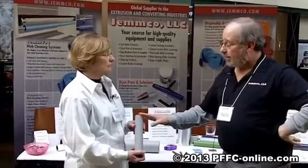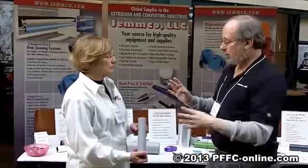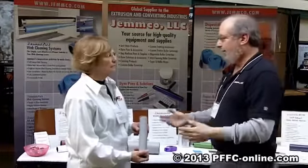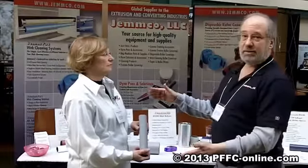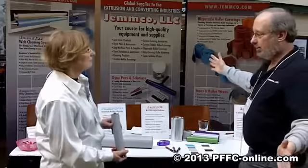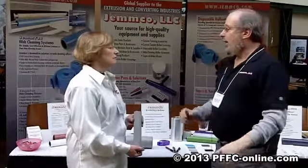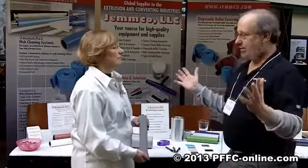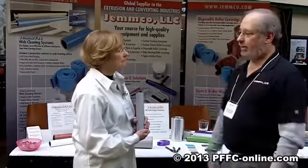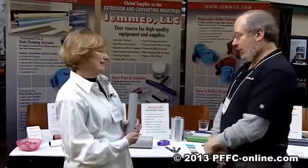The nice part about the sleeve is that it doesn't require any additional roller cores. It's no two-way shipping. It can either come by the piece, or we can sell it in roll length that come 10 meters long. So it's 394 inches. So if your idler rolls are all the same diameter, you can just hack pieces off as you need them, slide them on your roll, and you're ready to go. Easy.